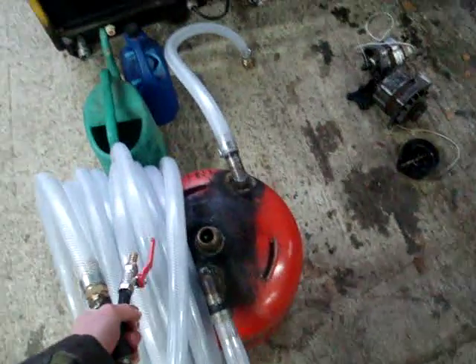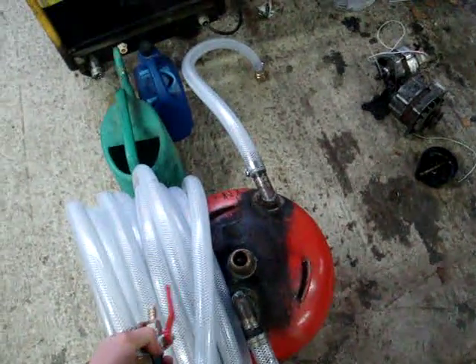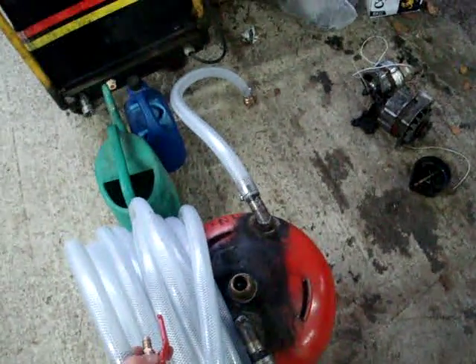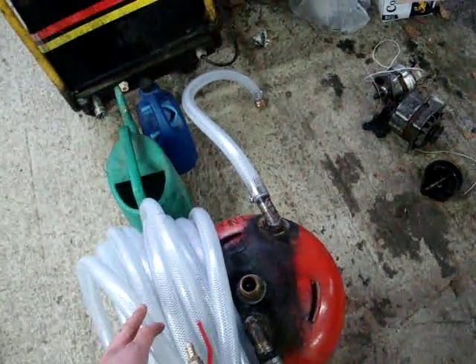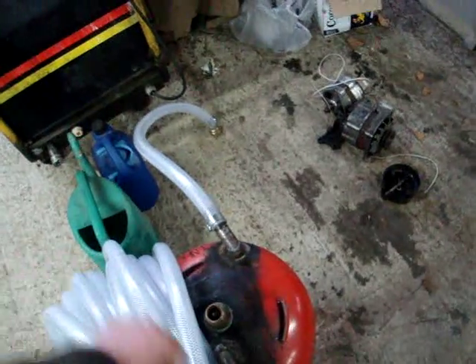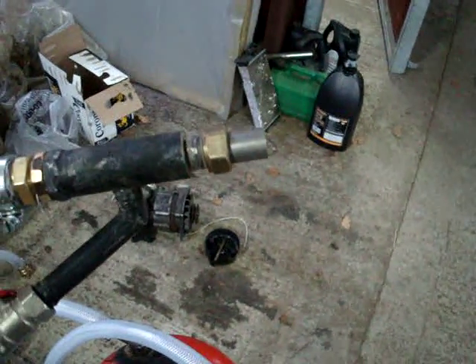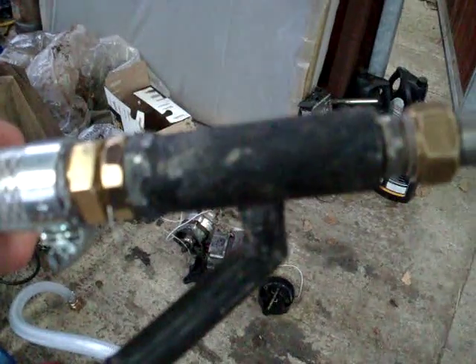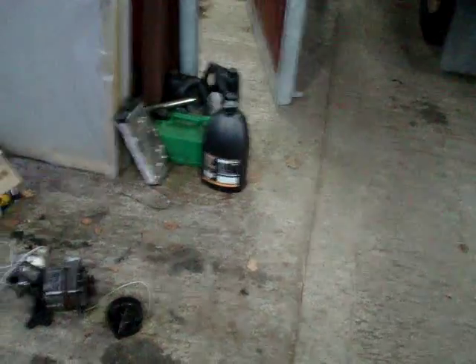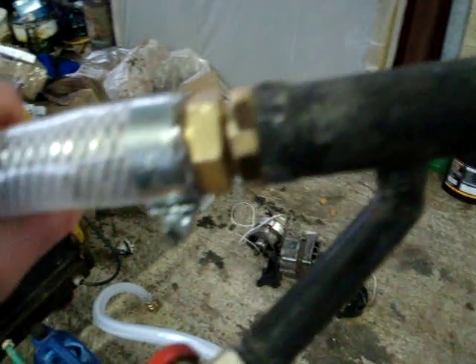The way my one works — which I think does quite a good job — is what I call remote, because instead of the sand mixing with the air at the bottom of the tank, the sand goes through a separate hose through the bottom of the tank and mixes at this T-join here at the end just before the nozzle. That's where pure sand injects into the airstream and gets blasted out. This other hose here is just raw air from the big compressor.